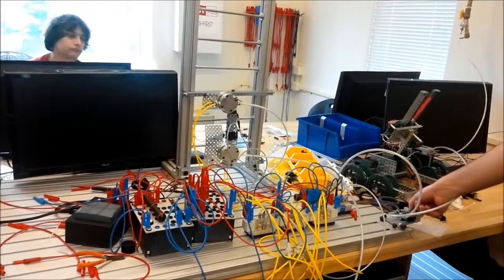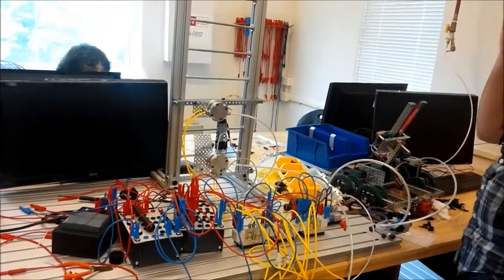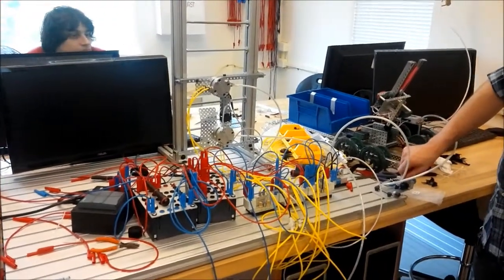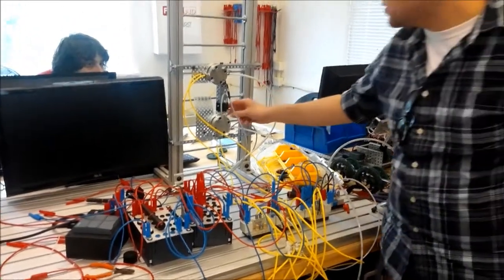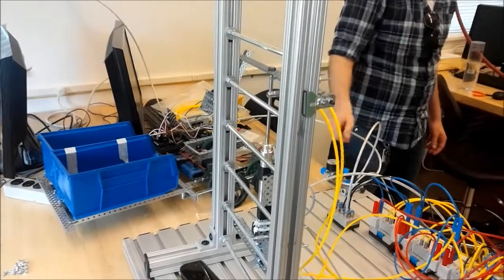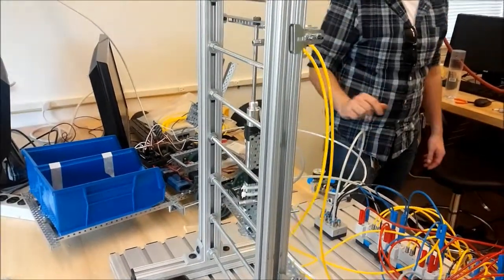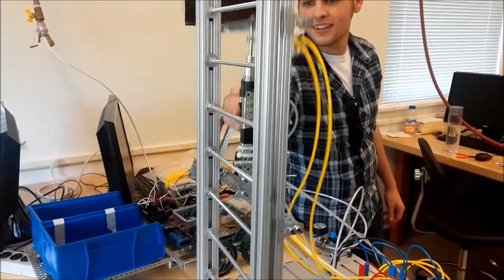And here's our phase 3 troubleshooting of our new design. As you can see here, we're having a little bit of trouble with our new design. Through troubleshooting, we found that the Festo reed sensors on the cylinder that we were using to activate each of the pancake cylinders were not working properly. As you can see here, as I adjust it, it picks up where the location of the dual acting cylinder is.